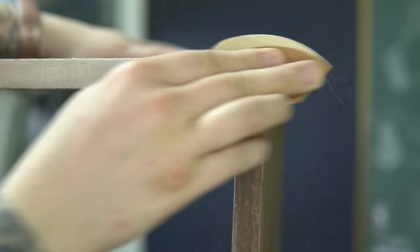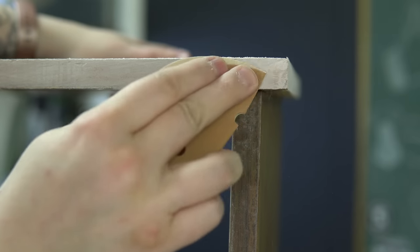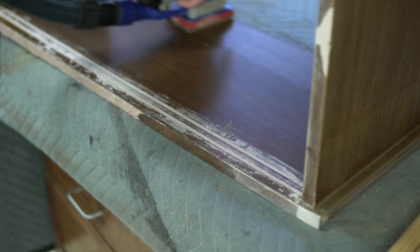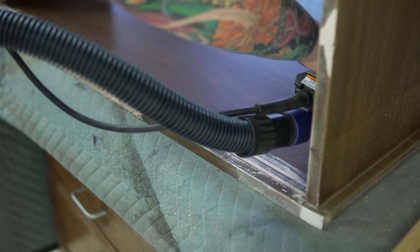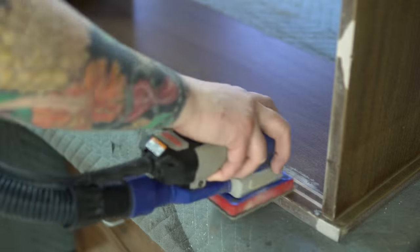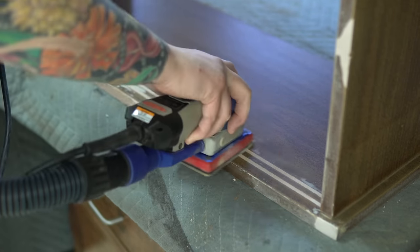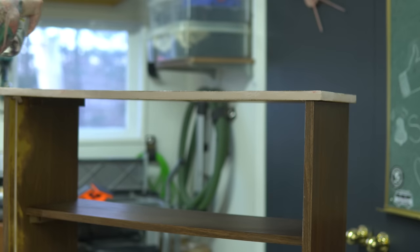You'll notice while I'm sanding this that there's a little bit of a wobble. There are some corner blocks on this piece with screws that need to be tightened, so I did address that, and it firms up even more once I put the backboard back on. Here is where I grab my surf prep to save myself a little bit of sanding time. Well, actually a lot of sanding time. Bondo is a bummer to sand by hand, but you can do it. I'm also doing this to lightly scuff the surface in preparation for paint.